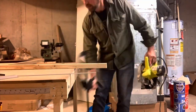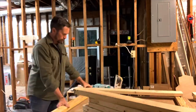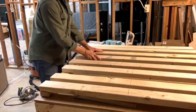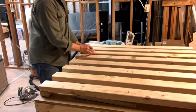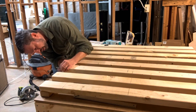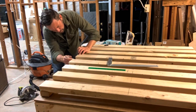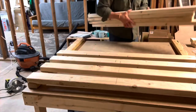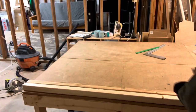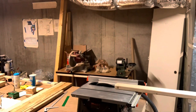Step one was cutting the two by fours into 46 inch long pieces — I ended up with eight of them and used the speed square as a brace to keep the line straight. For the outside support beams I used 46 inch pieces of two by three. Then I lined everything up to get a visual representation of how it was all going to be laid out. I measured the exact center of each two by four and drew a 45 degree line as a reference point for the rip cuts on the table saw. I also took one-by's and cut out 46 inch pieces for the inside supports.